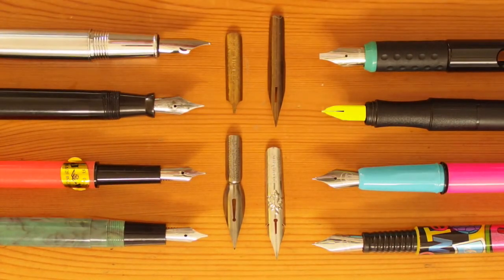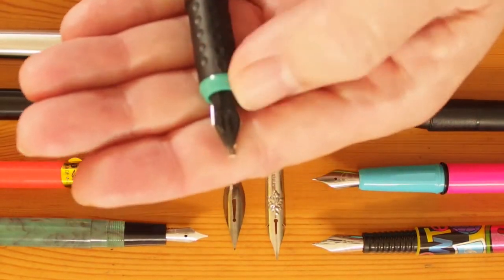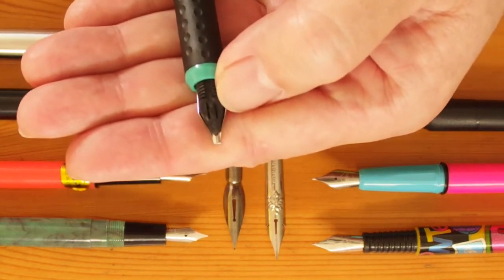In the least expensive or specialist pen nibs, tipping is often absent for cost or technical reasons. For very broad or italic nibs, there's usually no tipping as the pellets are spherical and cannot cover the required width.